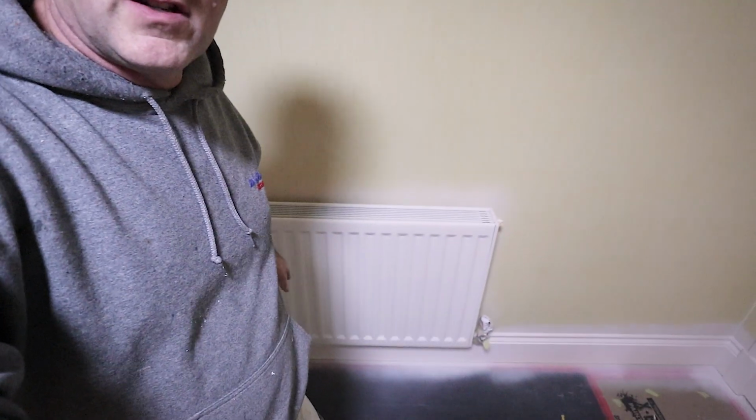We eventually cleared it and it sprayed lovely, and going around the skirting it's put a nice amount on. You saw I gave a second coat because the first coat was only a very light waft coat over the radiator, so that's had 2 now and I'm quite happy. You saw how I did the edges around the door, and you saw me tape up those hinges before I finished. So I'm going to leave that now. I'm going to wash my kit out. I'm going to tell it off for blocking up on me, but job's a good one.